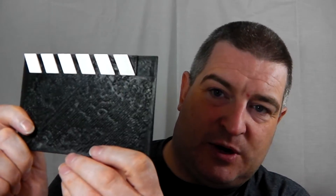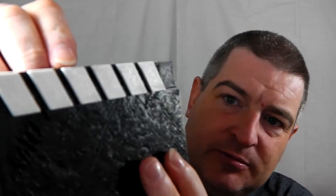I hope your parts don't look like this, because my parts look really horrible on the front face. That is purely down to me messing with the temperatures of the extruder to try and get the first layer to stick to the glass properly. The first layer is actually quite nice, but the final layer is quite not — it's horrible. Even on the white it's not very good, though it's not as bad as the black. Some people have said that black filament is a nightmare to print.